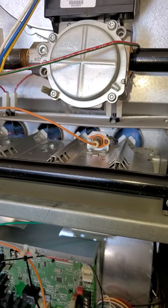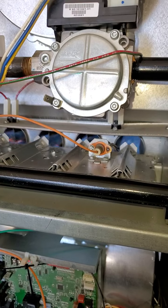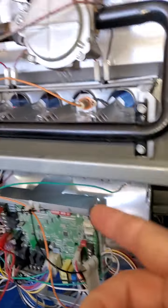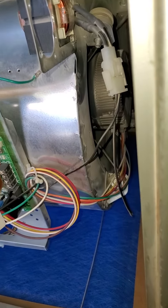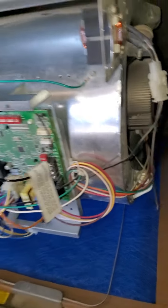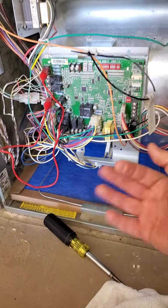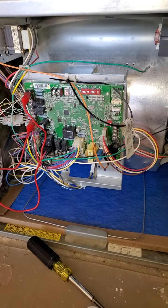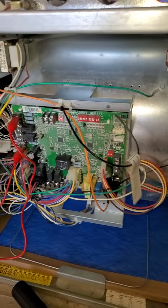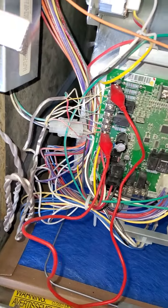After that heat exchanger warms up for about a minute, 45 seconds, the blower motor is going to turn on. We don't want to put any cold air into the home — it's already started, you can see it's spinning. The filter on this one is down here, it's a 20 by 25, so they have to take this off and change the filter every time.